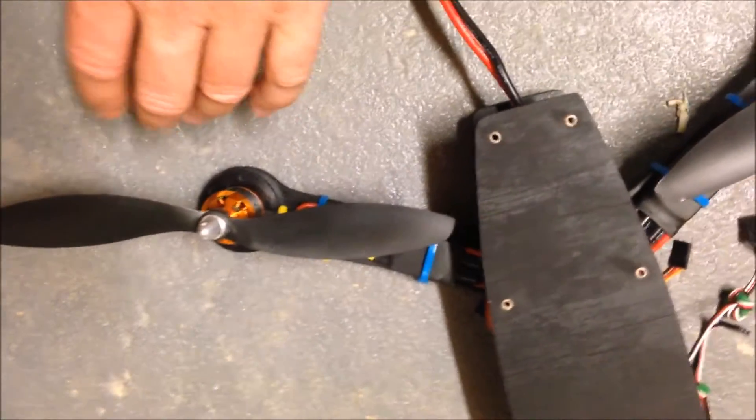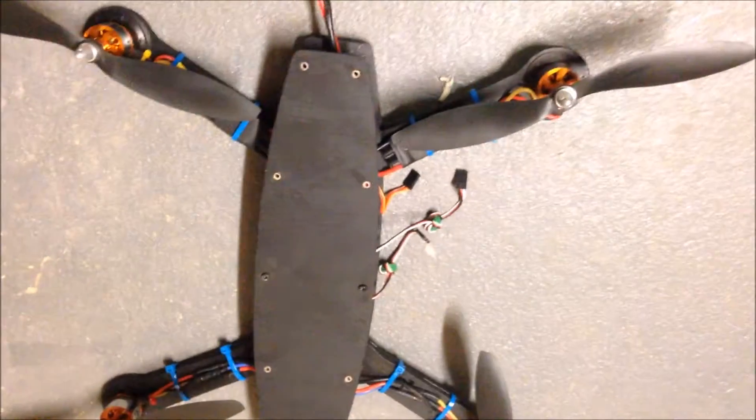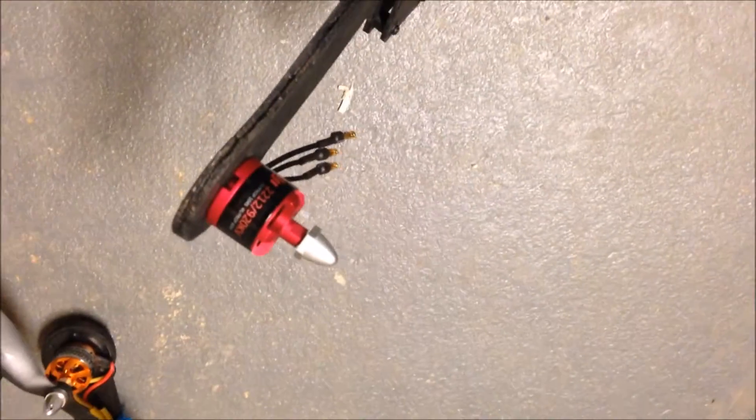The nine-inch props, which I designed this to run with, didn't quite have enough pull. So I'm going to build up now with my original frame, which has only got two-ply thickness of arms, so it's actually a bit lighter. I won't use as powerful motors — they're only 920kV — and I'm going to use some Hobby King ESCs.